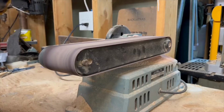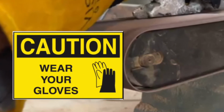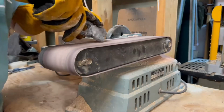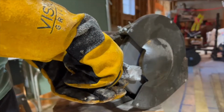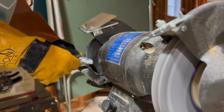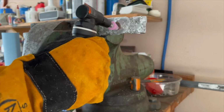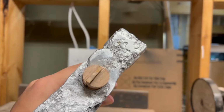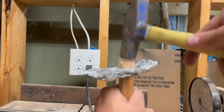Here's the comparison. After removing the casting from the drag, we used a grinding and Dremel method in order to smooth out the head. During this step, we used the Dremel to ensure that there are no clearance issues when installing the head of the hammer onto the handle. For the assembly, Joey wedges a splinter into the handle to ensure a snug fit of the hammerhead.